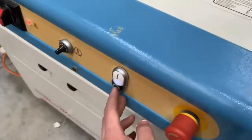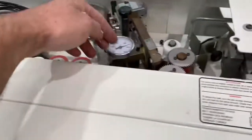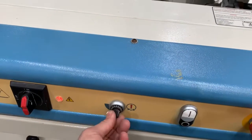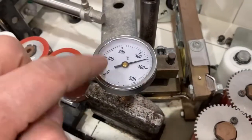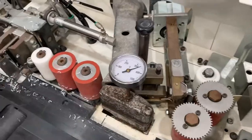Edge this panel all the way around. When finished, turn it off. The fan will keep running — but you can't just turn off the machine because you can damage the heating element. It's really important you always cool the heater down: set it to zero, give it a few minutes, and do not turn off the machine until the temperature is below 100 degrees, otherwise you can damage that heating element.